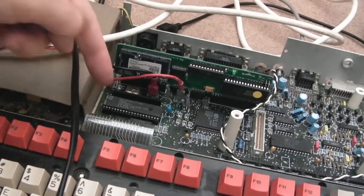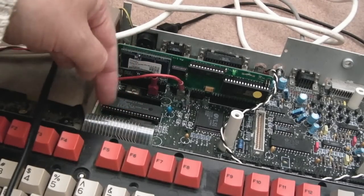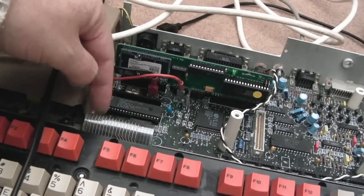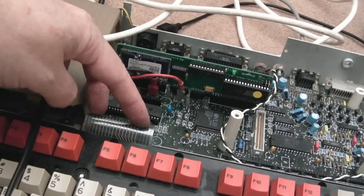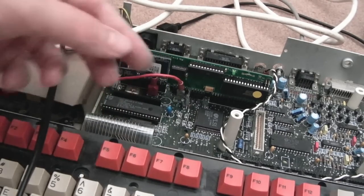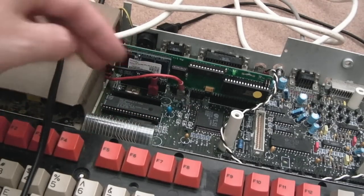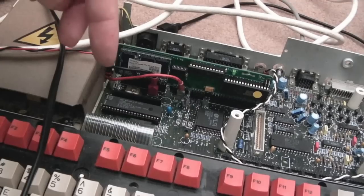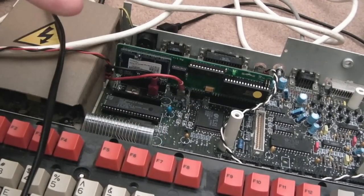One thing I didn't show, one of the keyboard connectors here, these ribbons, I coated the end with conductive ink because they were really, really corroded on this one. And I did the same on 3 or 4 others. Now, I tested them out previously and they've been all right, but the metal in the replacement connectors I've used is really weak compared to the originals. And on one of the connectors, one came out okay, and the other one pulled like 5 or 6 of the pins right out, bent them totally. As soon as I pushed them back in, they snapped off.